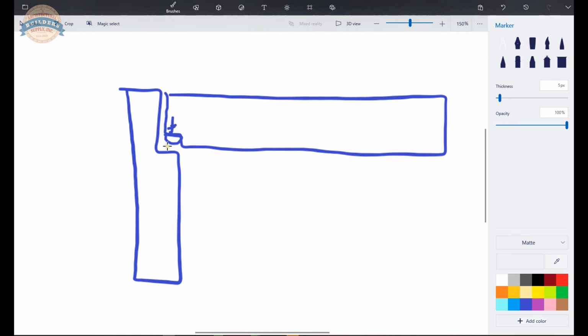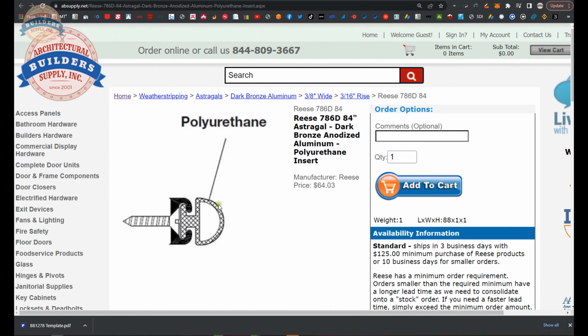You would have to mortise the door. I mean, that's not shown very well. That's going to come out like this. You'll screw it in here. That's an idea. I think it's, again, extreme. You would do that to multiple sides. We could also do this sort of concept with a spring in here so that you could adjust the projection of the material. That would be extreme in my opinion, so I wouldn't necessarily go with that.